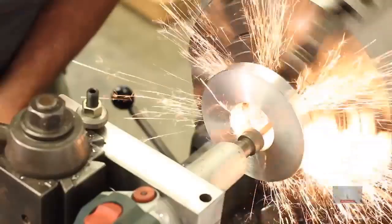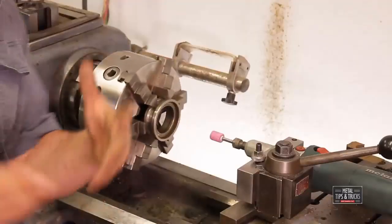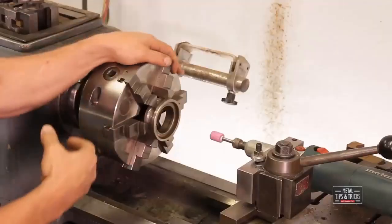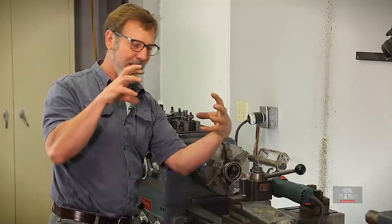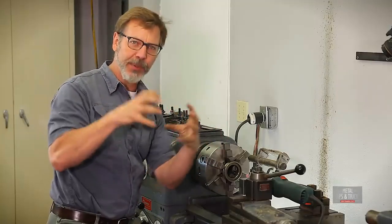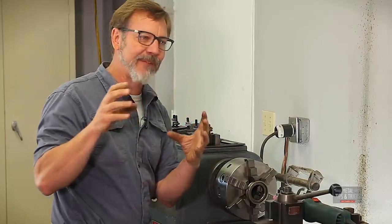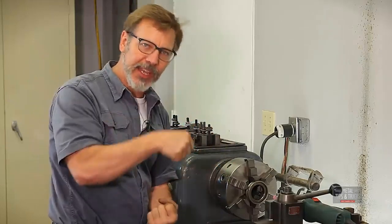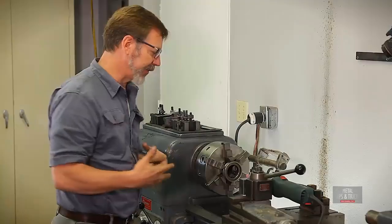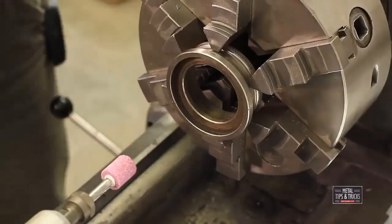Let's talk about why do you grind in a six-jaw chuck. The reason is you need to get all the jaws in alignment. With a three-jaw chuck, all three jaws are going to approach and give equal pressure all the way around. And a four-jaw chuck, you move those in and out to get equal pressure. But on a six-jaw chuck, you have a chance of variances in lining up.